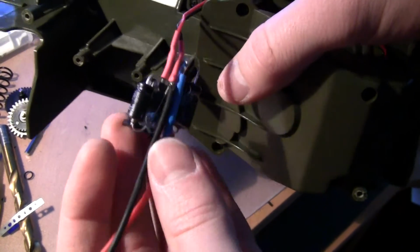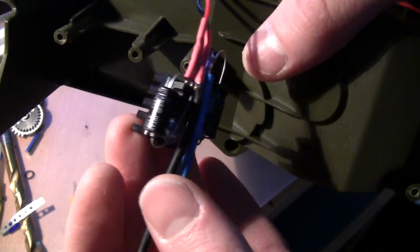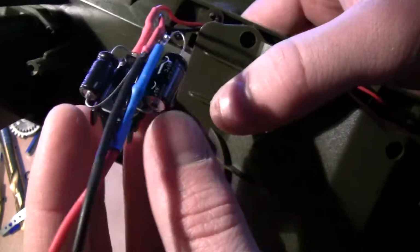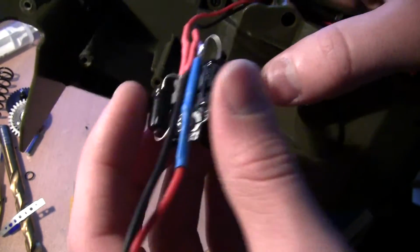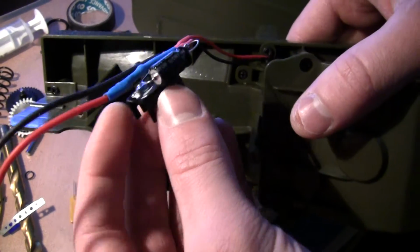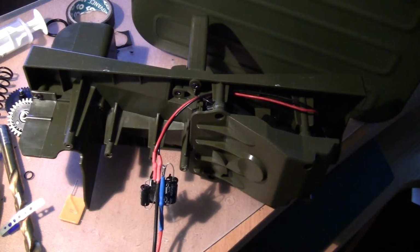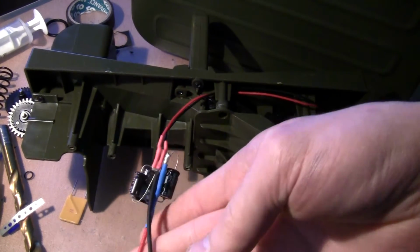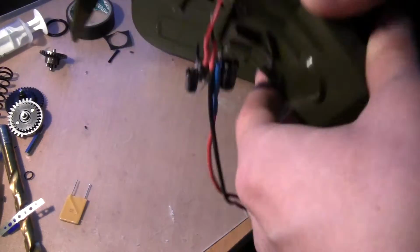voltage regulating circuit here. I'm going to put a link in the description on how to make this, but it's really simple. It's just one diode and then a 5 volt regulator and then two capacitors, and then I put this heat sink here to make sure that it stays cool. So that basically brings the voltage down to 5 volts, so then the mag winds at the proper speed.